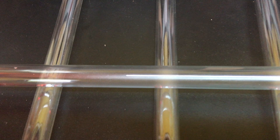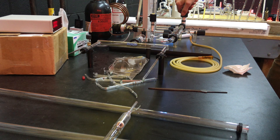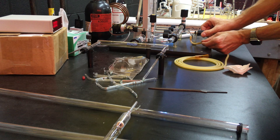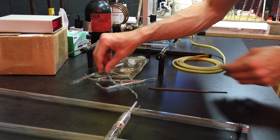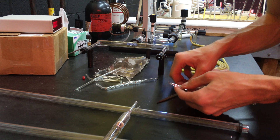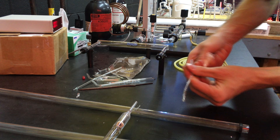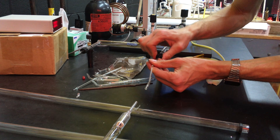As you can see, the tube has moisture and contaminants that must be removed before the tube can be filled with neon. To do that, we will hook it up to the vacuum manifold and suck them out. Before I attach it, I need to equalize the pressure in the manifold. I close the main stopcock, isolate the vacuum gauge, and use the blow hose tube to slowly admit air into the system until it reaches atmospheric pressure. The tubulated electrode needs to be welded to this 5mm tubing, so I will change it out for a piece that dips down to the level of the tube. A compression fitting seals the 5mm tubing to the manifold.